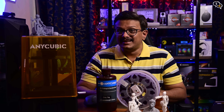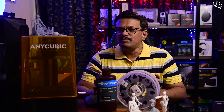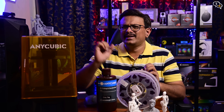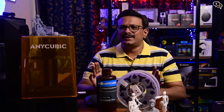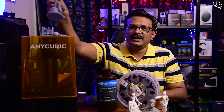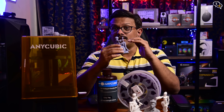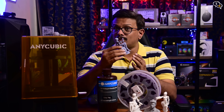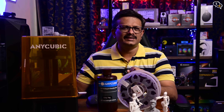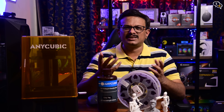I still have a lot to learn about SLA 3D printing — about the best way to orient the model for best adhesion and more. I'm still happy I managed to get a few successful prints. SLA prints are really detailed and print much faster than FDM. As one layer is cured at a time, you could have one or even six models at once and it would still take the same time to print. FDM printers have to move the extruder to every section, so the time starts to add up.